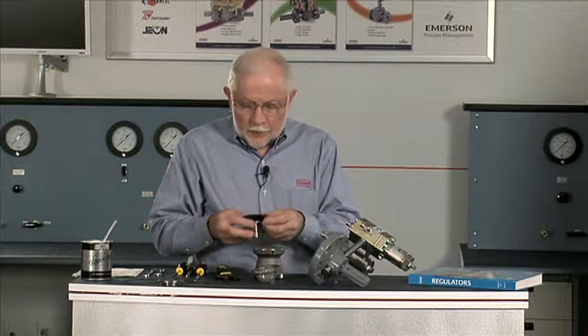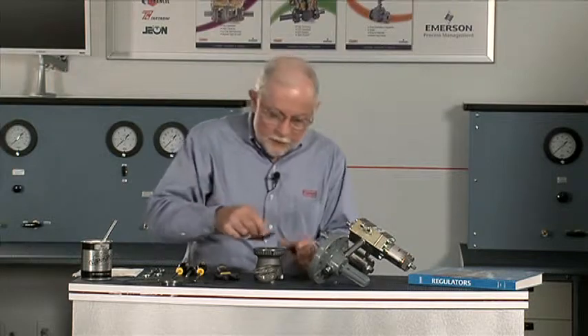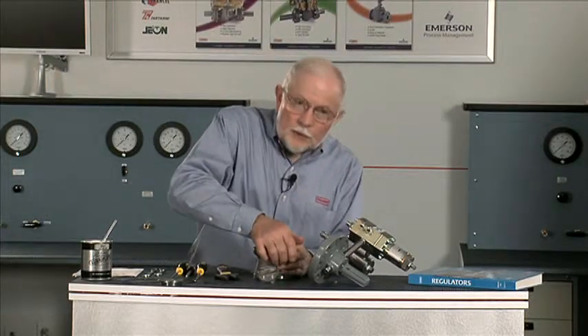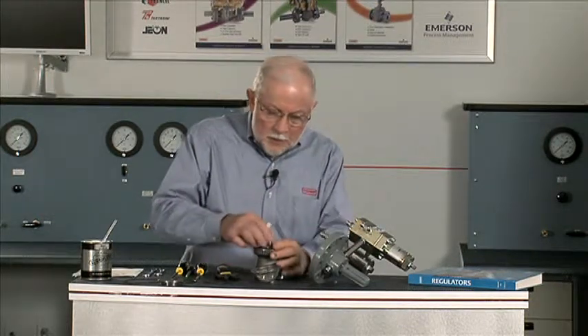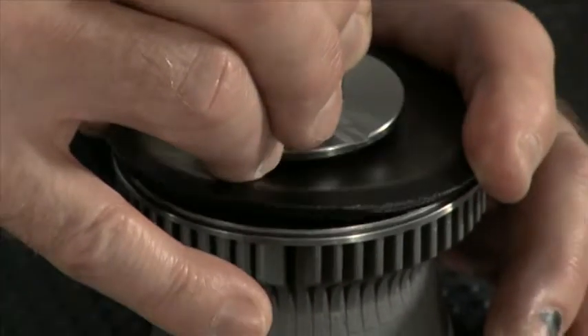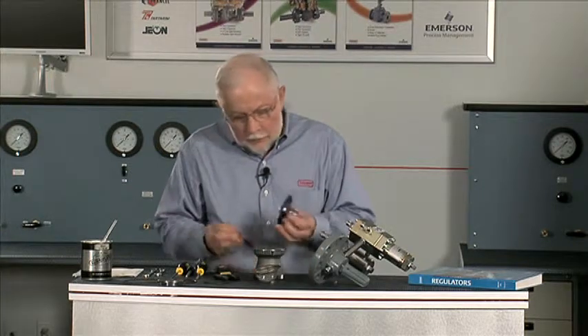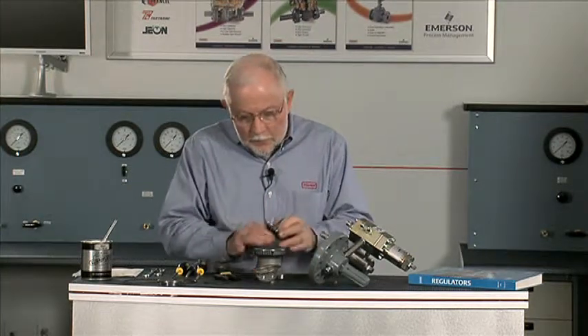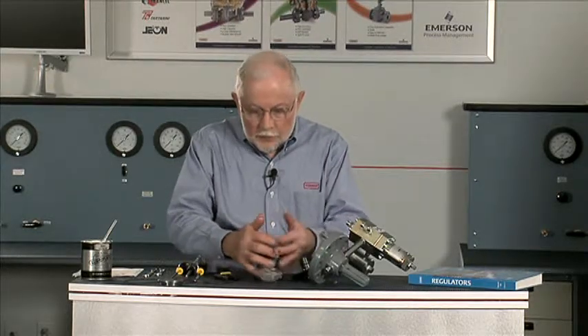The diaphragm itself is a very flexible part and has two purposes. The cage has a knife edge seat on it, so one purpose is to actually provide bubble-tight shutoff, which we can get even with dirt or sulfur in the unit. The other purpose of the diaphragm is to travel this plug assembly up and down without really deforming the rubber very much. Flow is going to come up, hit this plug, and then go down through the cage. This is a whisper design — it gets good noise attenuation because of the large expansion area in the body.